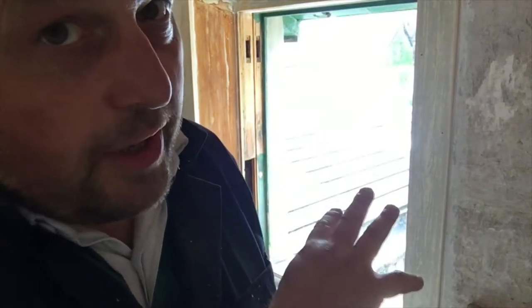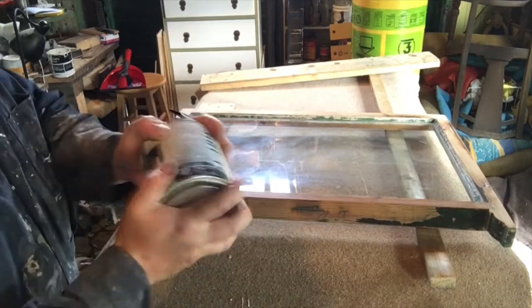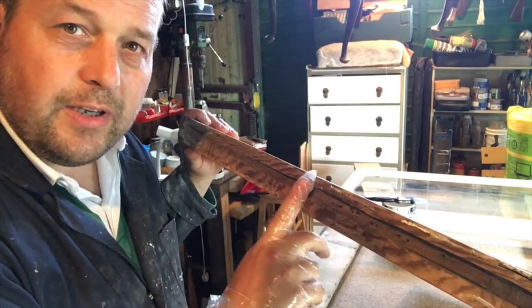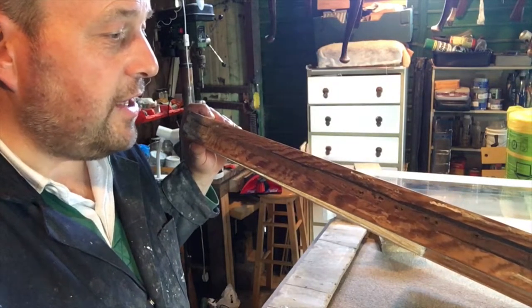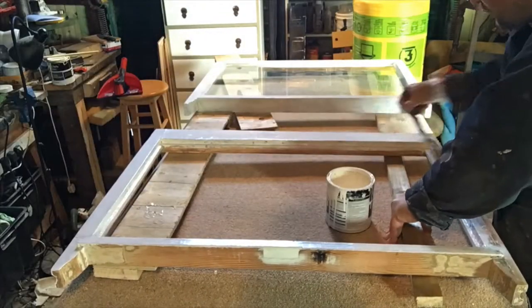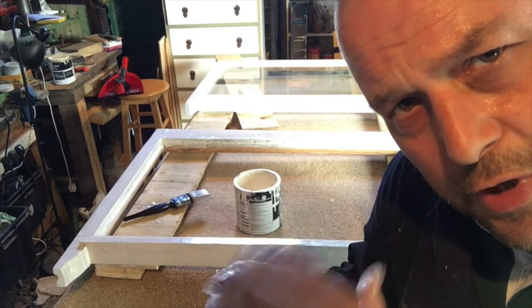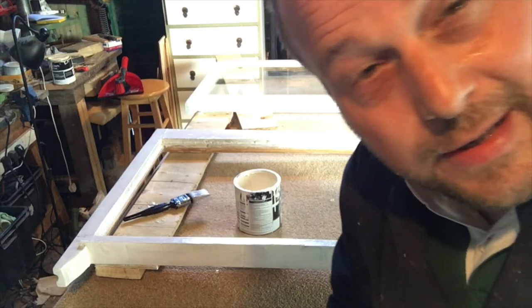The next step is painting — not just the surrounds but also the window frames themselves. I'm going to do the frames first, so first lay down some primer. You don't normally paint the sides here because it inhibits the sliding up and down of the sash window, but I find that if you paint it with a non-glossy coat — not the top coat — you should be fine. We'll let that dry overnight. Tomorrow we'll turn them over and do the other sides. In the meantime, we're going to head upstairs to the window surround and paint that next.